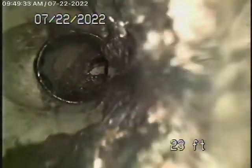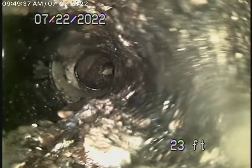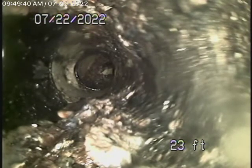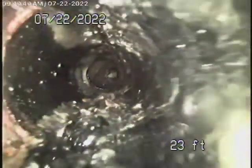This looks like ABS plastic here now — yeah, ABS plastic with PVC. So there is some cast-iron that's getting pretty old and some PVC piping. Obviously we cannot check every pipe in the house; this is the only entrance available. But there is a lot of grease build-up in this line as it comes back towards the kitchen. We're definitely going to recommend that the line be hydro-jetted.